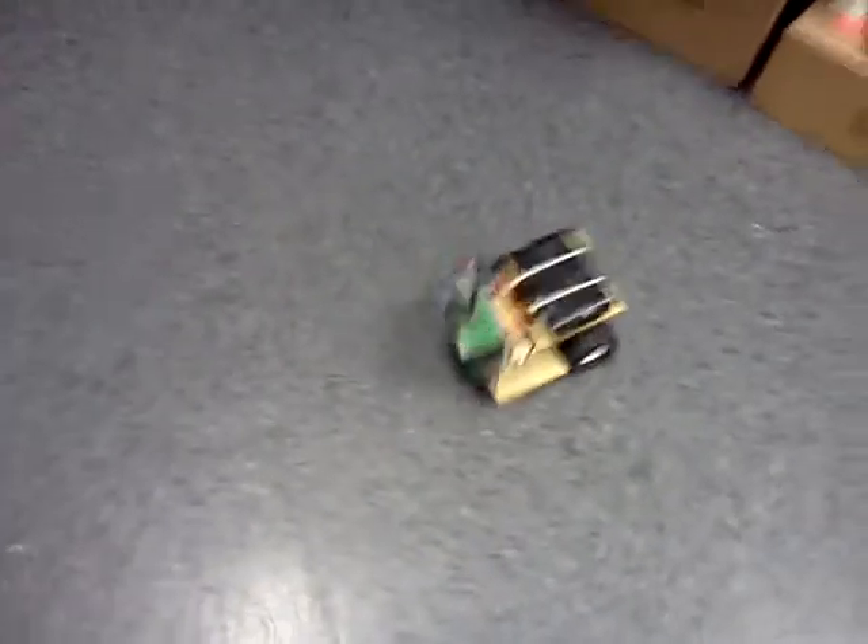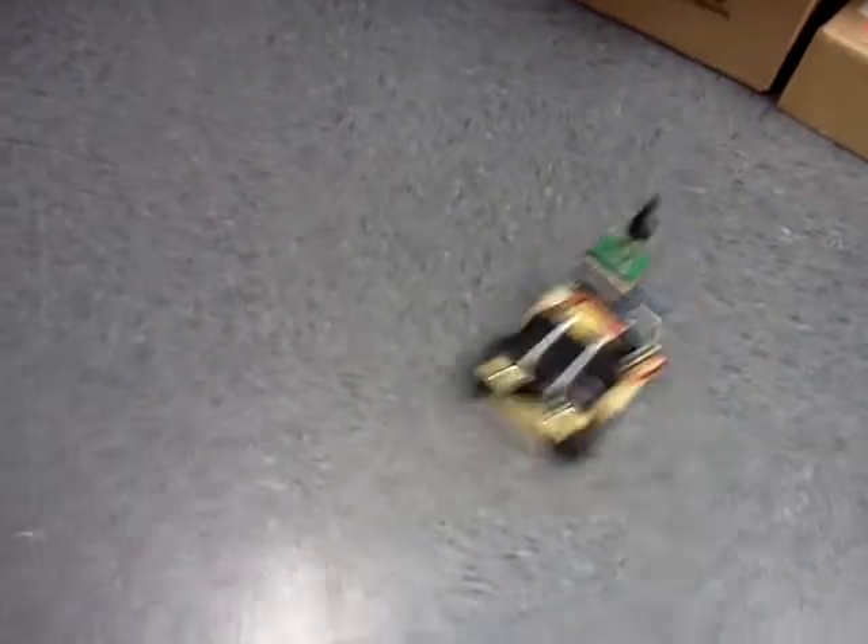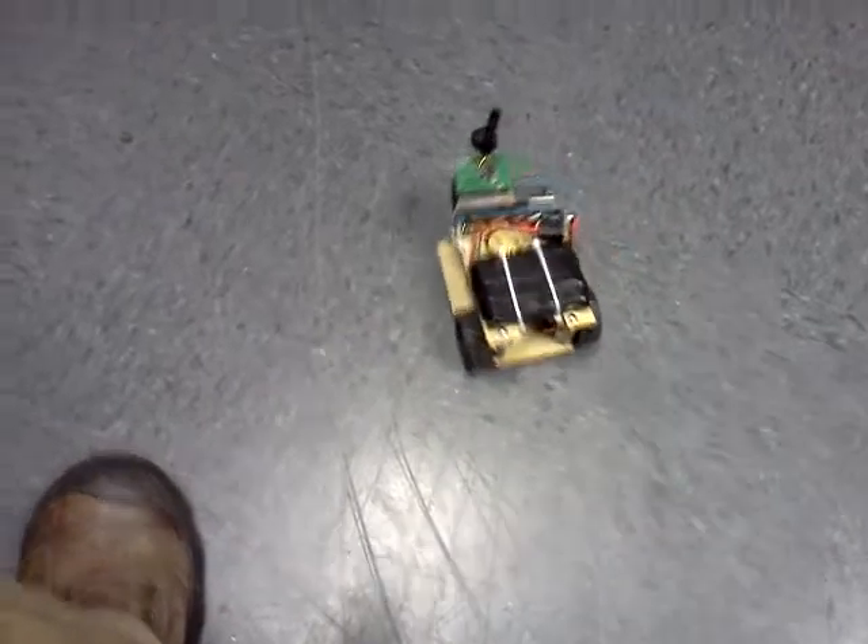I found that I get a lot better control running it that way, but that's really not the cool thing running right now. I finally got the encoders on the wheels, and so I have full PID motor control of the motors. I don't think my PID values are set up very well, so I'm not running very fast because I think I have really low gain.